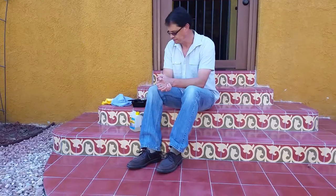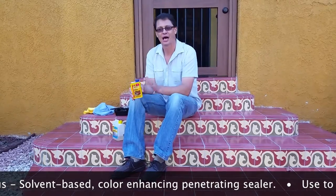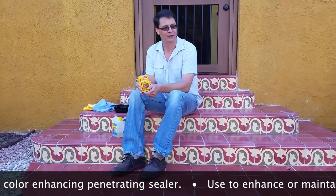We're going to add a coat here to brighten this up and a second coat to be done with it. This is something you may do occasionally with tile installed outside because it'll fade a little bit with radiant energy from the sun — maybe once a year or once every few years on an outside installation, and probably only once or twice on an inside installation. One thing to remember with a stone-enhancing penetrating sealer: the results are irreversible. Make sure you try it first and are happy with the results before doing the whole sidewalk or area.